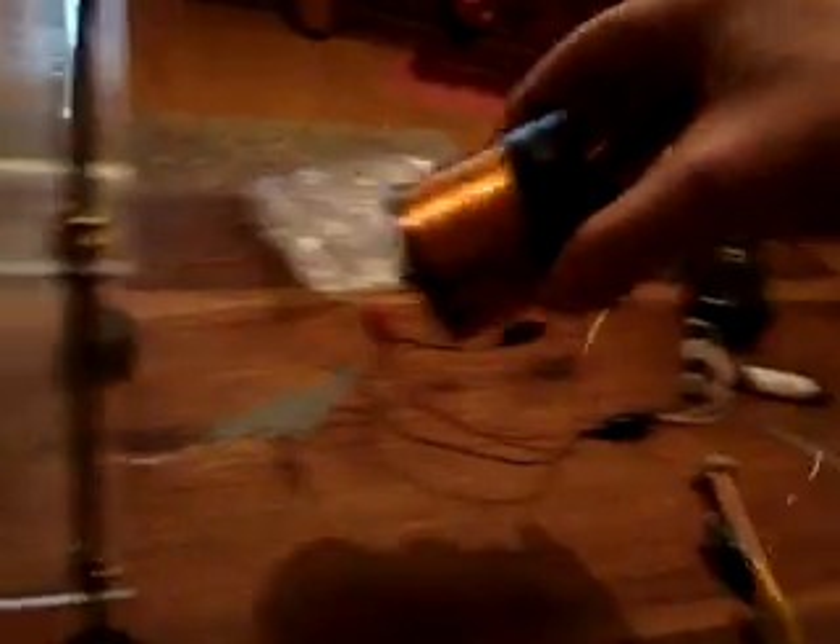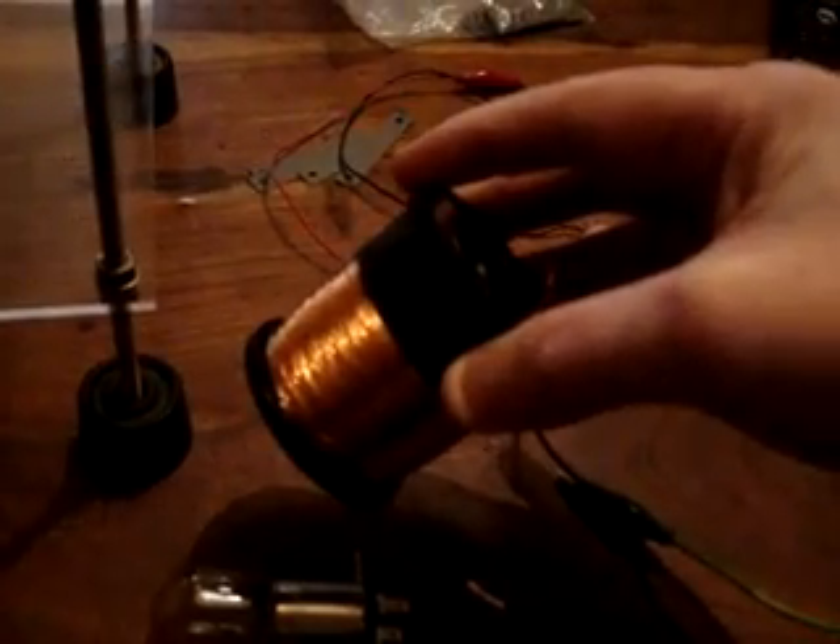So let's disconnect that and move the generator coil. Take the core. Now we have this coil, which is high inductance — many, many turns. Again, 500 grams or about a pound, this time of 0.3 millimeter wire. And this is bifilar wound and internally serially connected.